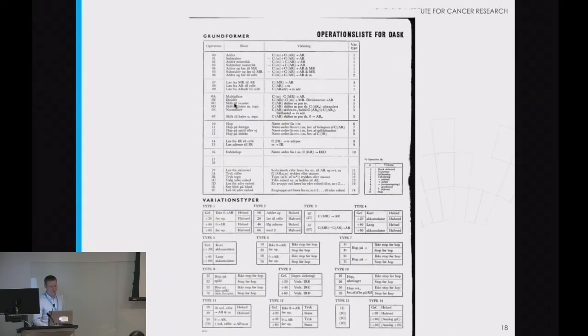Then we have multiplication, division, shift left, shift right, signed, normalize, and shift left unsigned. So these are kind of your normal math ALU operations. Then we have 4 jump instructions. So you have unconditional jump, branch on sign, which basically branches if greater than or less than 0. So jump on sign.